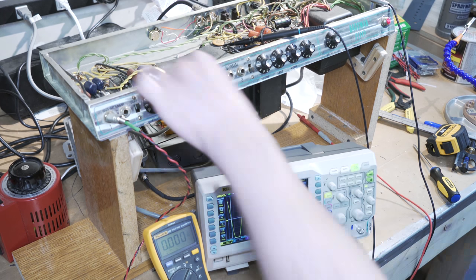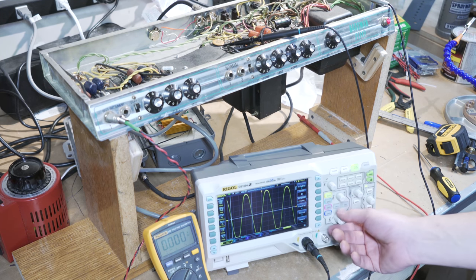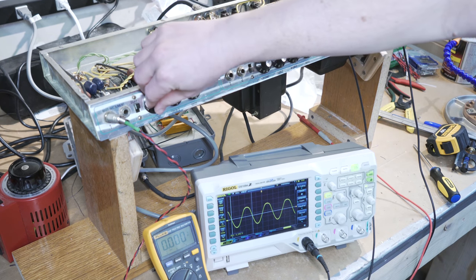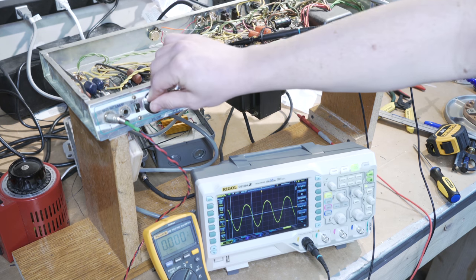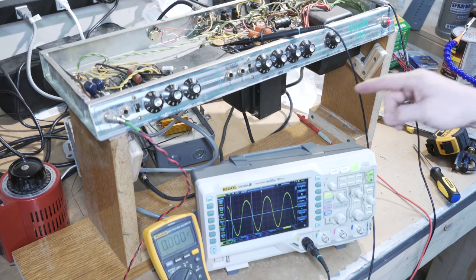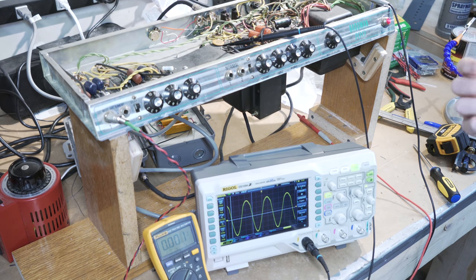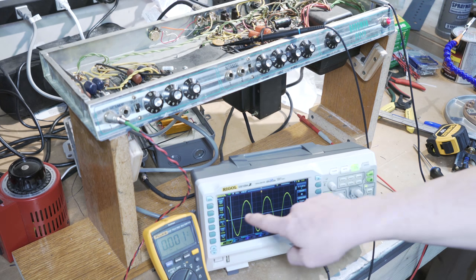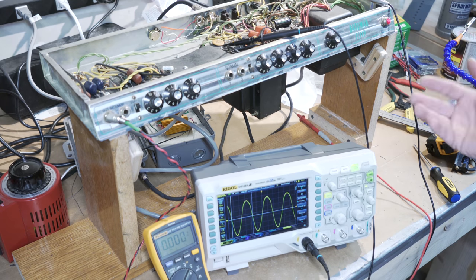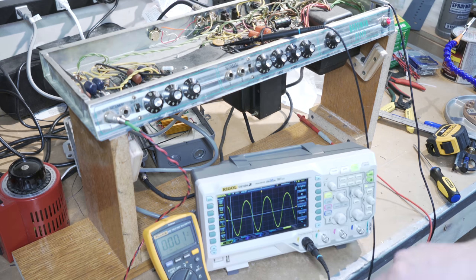I could really, and now we can start to see some of that characteristic rounding off of the top as I really start pegging the input. See that? And you can hear the noise because it's actually creating vibrations in the resistors behind it, I believe, if I understand correctly. They're basically pushing so much current through those that it creates vibrations in the resistors. Although somebody can correct me if I'm wrong, maybe that's a vibration in the transformer. It's still getting into a nice heat, into a dummy load. But you can see the characteristic kind of compression that starts happening.